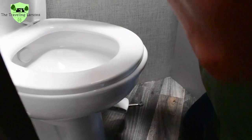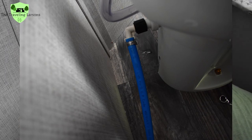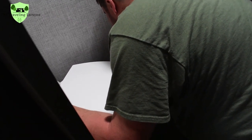That's pretty well secure. I'm going to check it. Now what I should have checked before I did that is if the supply line is actually going to work — and the supply line does work, and that just goes finger tight. Finish tightening the toilet a little bit — it doesn't need to be so tight that you're going to crack it. Just tight enough.